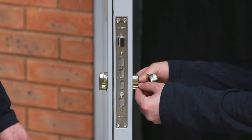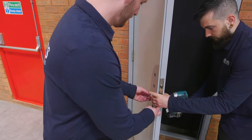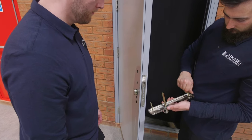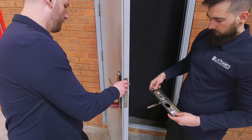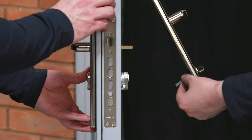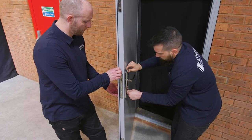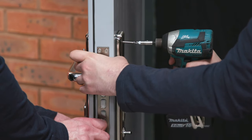Fit the cylinder covers over the Euro cylinder, ensuring the screw heads are on the inside for security. Fix the two thread extensions to the external handle. Insert the spindle into the spindle cavity and place into position with the plastic gasket provided. Moving on to the internal handle, pull the thumb turn's hinge spindle down and make sure this is inserted through the relevant hole when aligning. To finish, use the remaining plastic gasket and align and screw into the external handle.